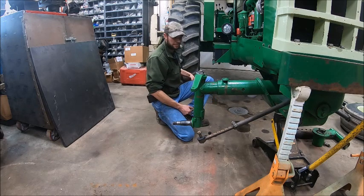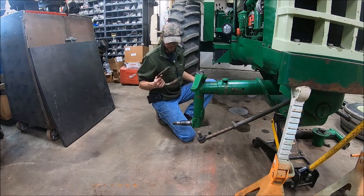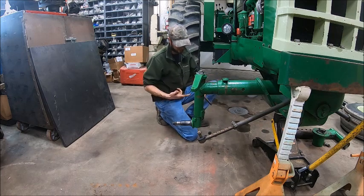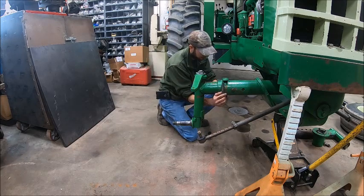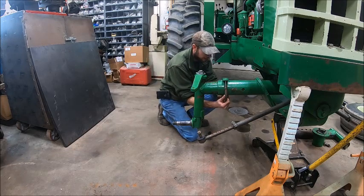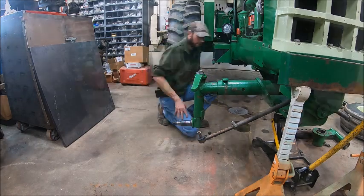And just a friendly word of advice on these damn U-bolts: if you're redoing an axle that's got the original ones in it, just cut the damn things off and buy a new U-bolt. Unless the threads are in good shape and you can get it apart without much fuss, you'll save yourself a bunch of headache. We are gonna have to close this damn thing up.